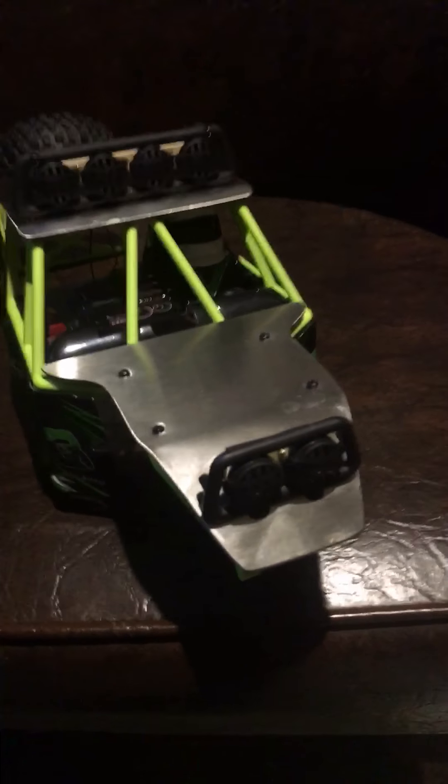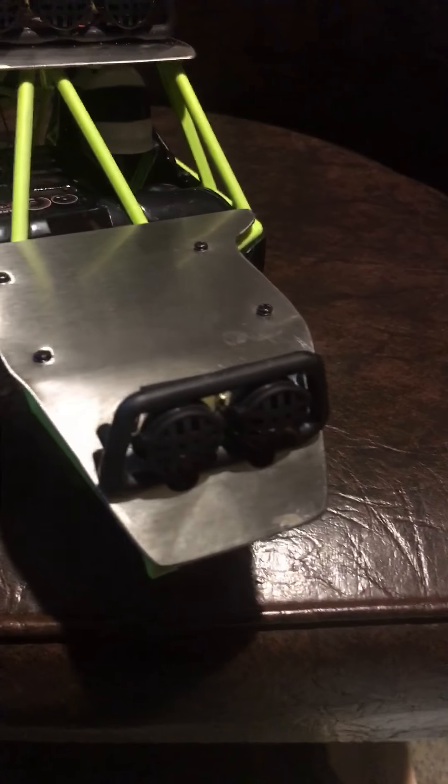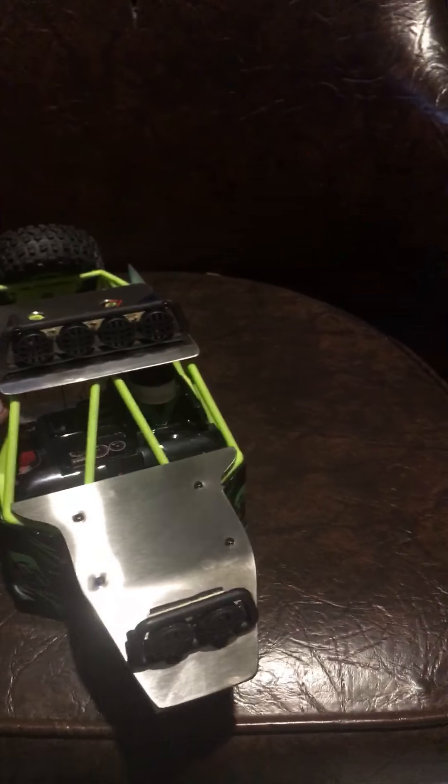I'm gonna have to live with it. Today it took me about two hours to do that. Like I said, I didn't have the best tools so I had to makeshift whatever I could. I'm gonna be doing these panels tomorrow. I used a 1/8" drill bit for these — I wouldn't go bigger than that because it probably won't hold the screw in for very long.